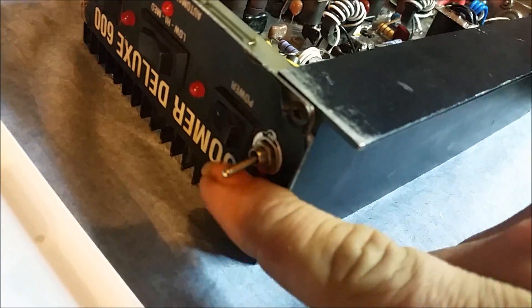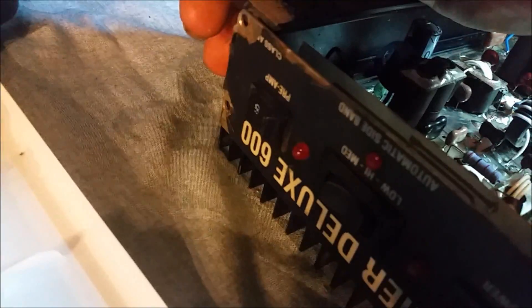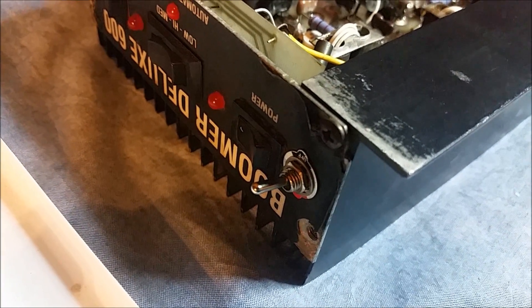Make sure to leave this power switch switched off. Somebody went in here and I see people doing this all the time — it is a bit of work taking this out and replacing these switches, I understand that. Your preamp switch is probably going to go out next — just letting you know, it's working now but you can tell it's on its way. That's common with these amps. The power switch is actually messed up internally and it's having some sort of diode effect causing reflect if you turn it on. Do not turn that switch on — make sure it's off. Just use the switch that was added.